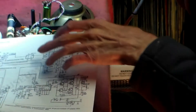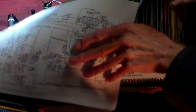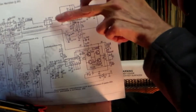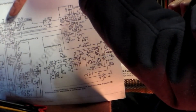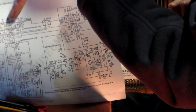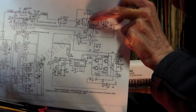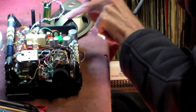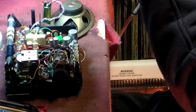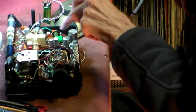That's the crystal circuit — like you get on the same piece and stuff. That CD IC is one that I think had the problem. That's the crystal. That's the IF IC there, which is the yellow one. And the green one is the audio side. All in chips, apart from a few components here.